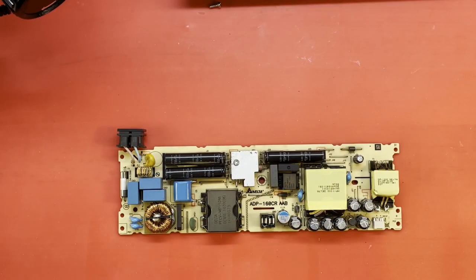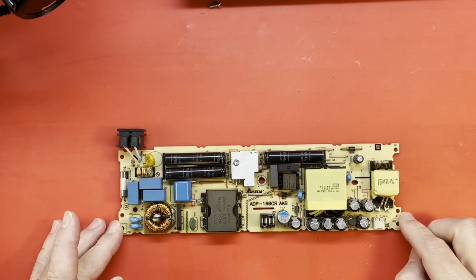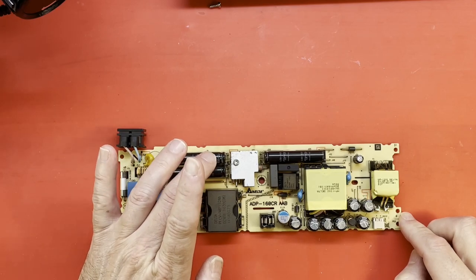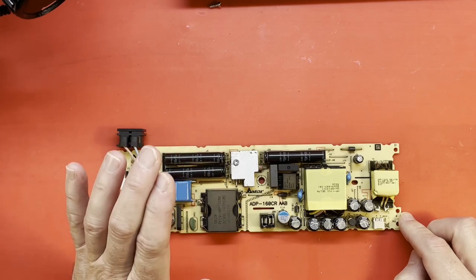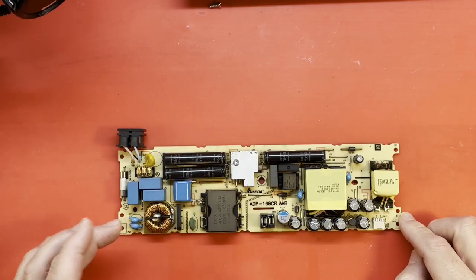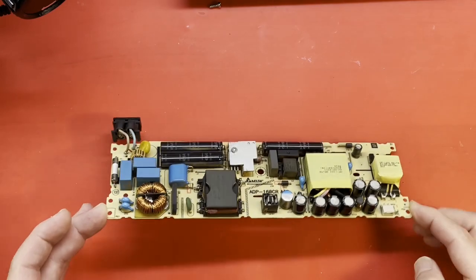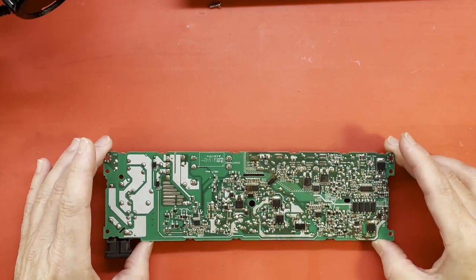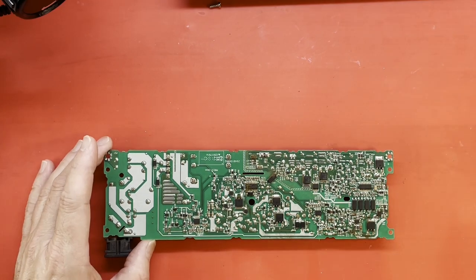All right, so we have five volts, no 12 volts. But it did look like our capacitor was charged up — over 300 volts on these two capacitors — which kind of tells you the power factor correction circuit is trying to work, doing something. We can see some dust built up, no roaches though. I really should have blown this thing off outside.